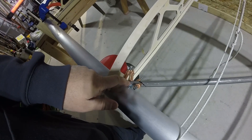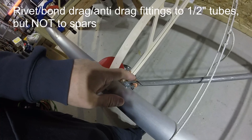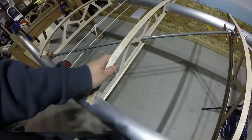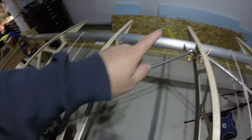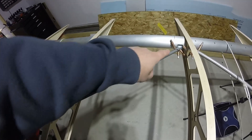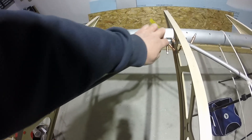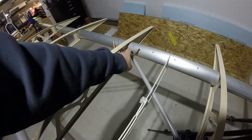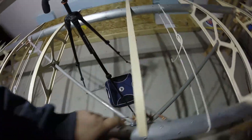I can mix up the Hysol with micro balloons to bond the fitting to the tube, slide the tube through this rib which can just sit here and float until the very last. I will have to bond and rivet that — of course you have to make sure to slip it through there, otherwise you're screwed. Bond and rivet again — tube to fitting, but not the fitting to the wing. Fitting to tube will be drilled up. Slip through here, done on this end.